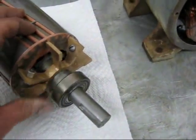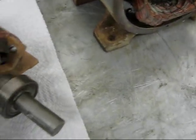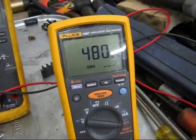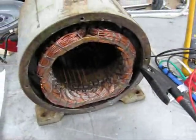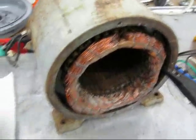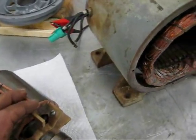It's an early ball bearing motor. The bearings are a little rough, but they still roll. Checking the winding — I checked the insulation resistance and got 480 megaohms. That's pretty good. I cleaned it and put a little extra varnish on there and baked it. Everything looks good. I'm going to go back together with it and make a test.